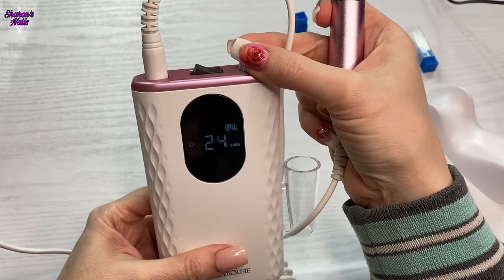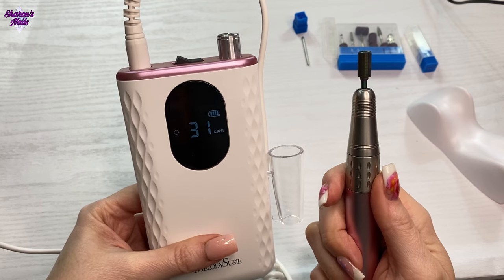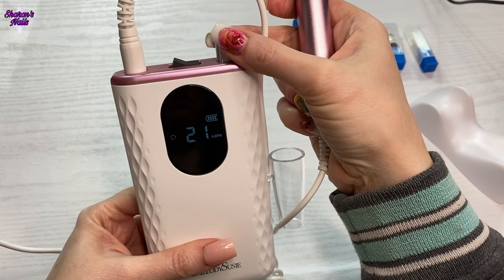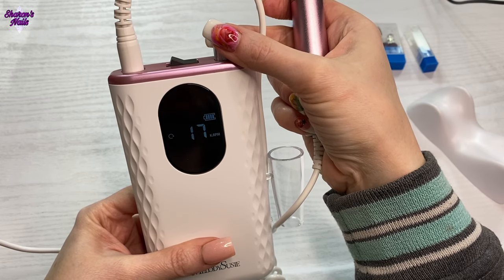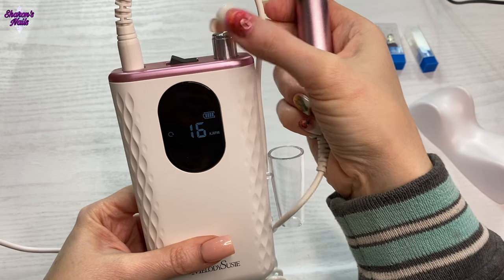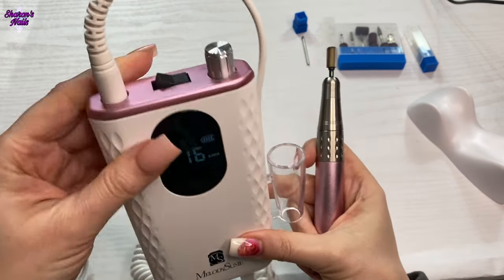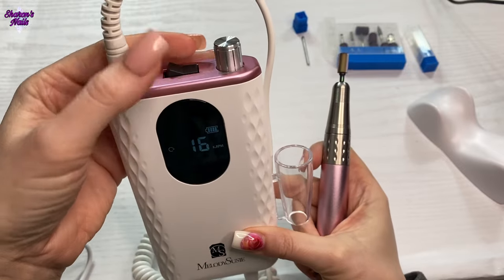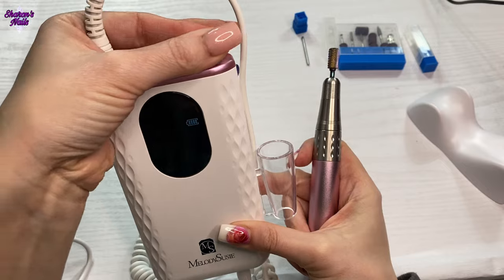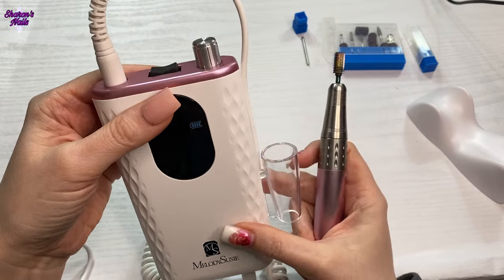Can you hear that? There is hardly any vibration coming from the handpiece, and that's at 20. At 30 it's a bit noisier, but I'm never going to use it at 30 — I don't think anybody does. I usually use it between 15 and 18. There's hardly any noise there. You've got your forward and your reverse — you would switch it off by turning it, and then do forward or reverse. Don't switch forward or reverse while it's running because that can damage it.